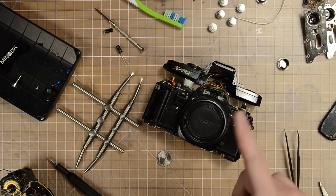With all the detailing done, we can finally reassemble the camera and get it into its naked, skinless form. There are plenty of imperfections to be seen, but we're not going to look too closely at those. For this project, I procured some crispy white leather to put on the outside of the camera. I'm just tracing the outline of a pattern I made from the pre-existing skin with a pen. I've had a few people recommend using Plyobond to reapply leather and leatherette to camera bodies, but I haven't gotten around to buying any yet, so I'm going to stick with what I know and just use this water-based contact adhesive. I sanded the back of the leather down to try and match the thickness of the spaces where it sits, but it really wasn't my best work. I really wish I could just order it split at the correct thickness, but most distributors don't go below 1.5 millimeters.